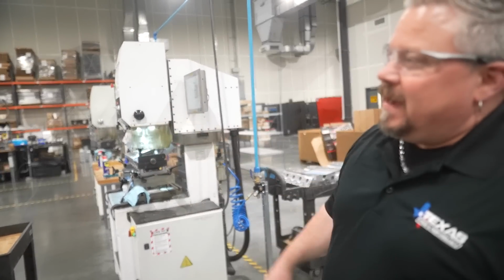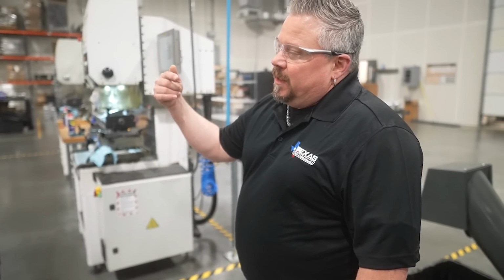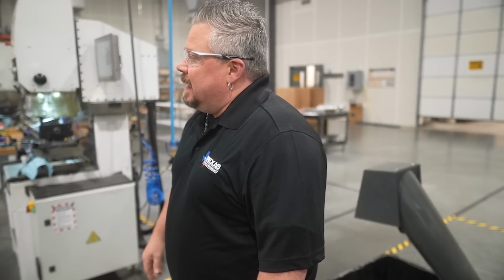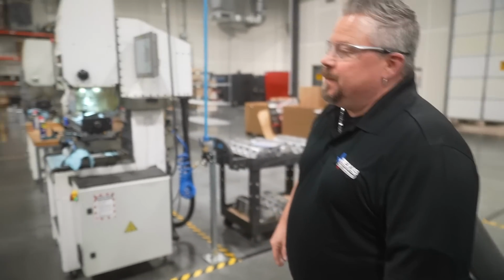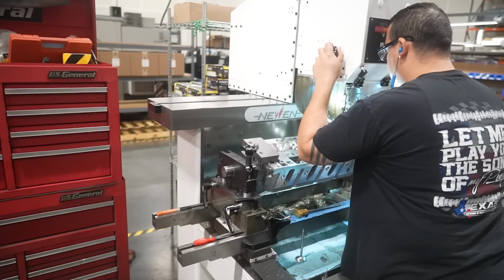And then once it gets over here, this is where we do all our valve jobs. The new one is the superior valve job machine in the industry. It's CNC, so it programs just like it's a little lathe cutting each one of the seats. We have 4 of these machines. Most of the time they're all 4 running. So it's better than just taking the little single blade tool and going around it.